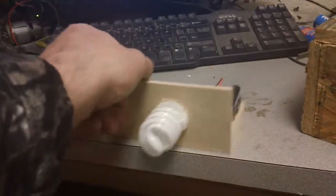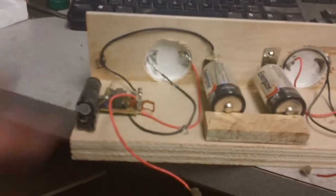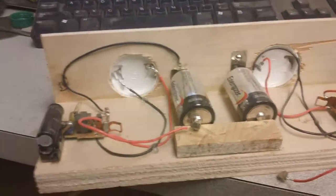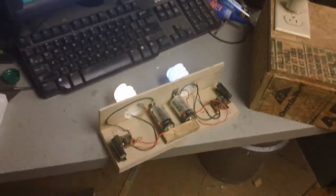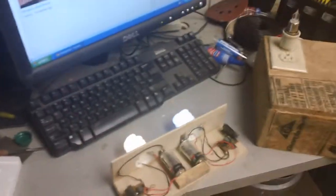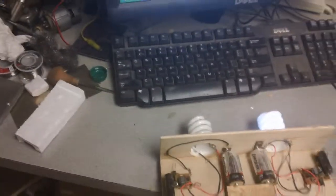Just a little gee-whiz here. Here's one we put together — there's two disposable cameras, and what I did is there's one bulb running each side. I put magnets on the end of these little wires so they'll magnetize and stick to the battery in order to light up — see, the light's lighting up there. They're both running off 1.5V C batteries. I put a spring in the back so the battery stays wedged in there and you can use the magnets to turn them off and on. Those come out of the disposable cameras — we just took them out and glued them on that board, and obviously we left the flash still in there.